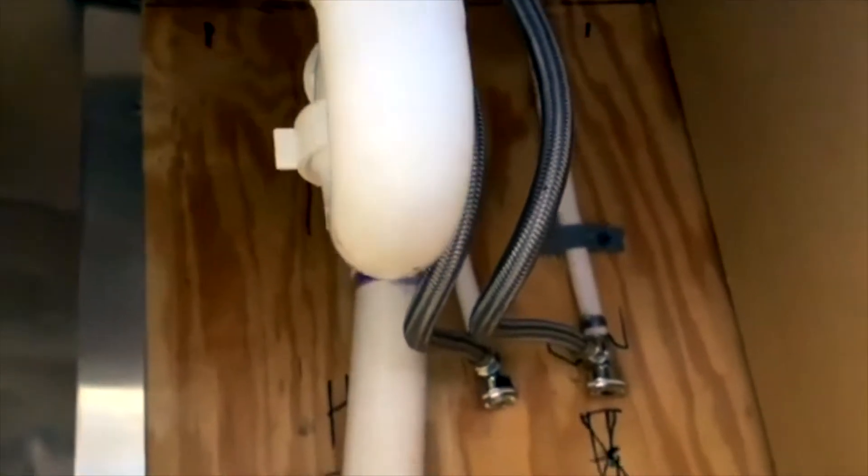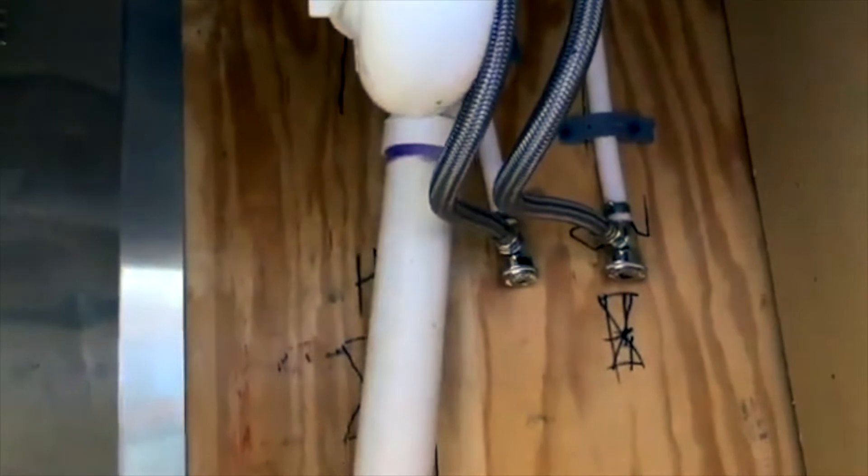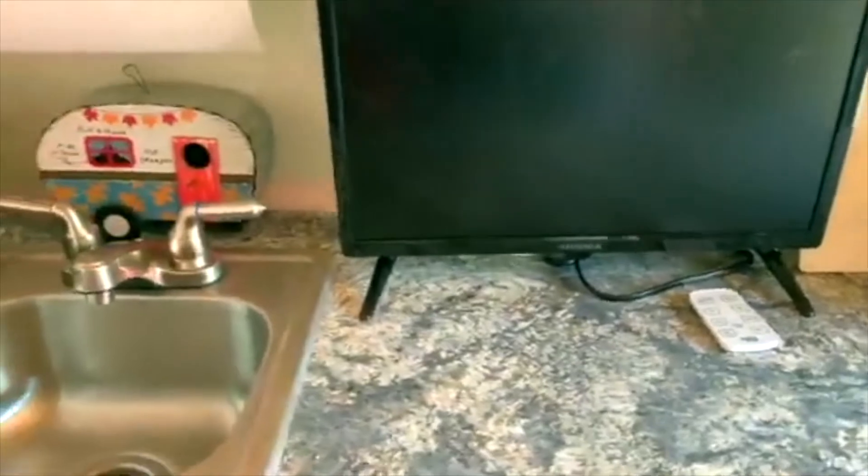Because of that setback and the fact that there's a corner here, I ended up just taking the back off the cabinet and then having to cut the sidewall off about three inches, which allowed me to keep this cabinet in line with the other cabinet to the middle. So that was a way to pick up three inches of space without really sacrificing the functionality of the cabinets or butchering them up too terribly bad. As a result, my countertops are not as wide as in a standard home — they're only about 22 inches, as opposed to 25 and a half in a conventional home.